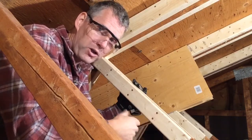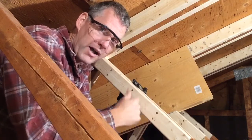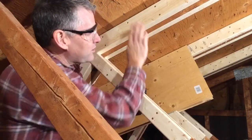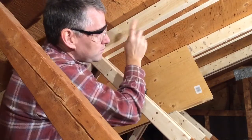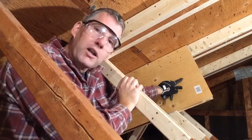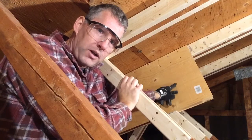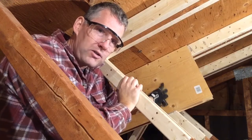You could cause long-term damage, so you're going to need a building permit and somebody to evaluate it. I'm just showing you how I have to fix mine. In this case, we sister the top cord with new wood on both sides, and then the last step is putting on a plywood gusset plate — we're not going to use those small metal ones, we're going to make one out of plywood.